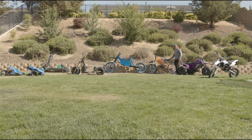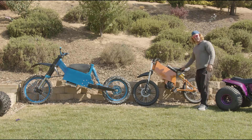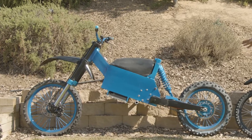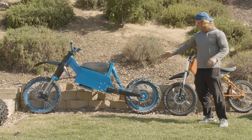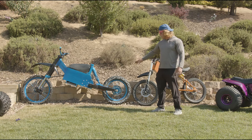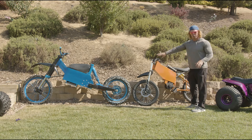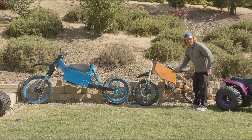Electric lightweight dirt bike — more in depth here — and these are all the other creations I made. Super fast electric. The whole purpose to build this one was to do the opposite of that one, because that one was just too heavy. It had double the power but double the weight, and probably more because the batteries are 120 amp hour, 88.2 volts — the batteries themselves are super heavy. It's almost like an enduro or sport bike, but so heavy. The goal with this one was to cut half the weight or more and keep the torque-to-weight ratio really high.